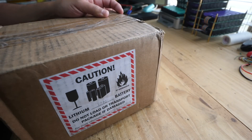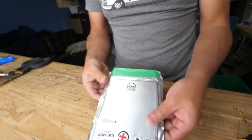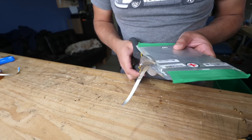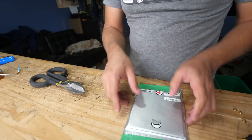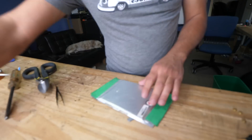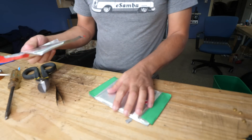The first thing is to build the battery packs. We've chosen these 8 amp-hour lipo pouches. In my opinion, these are packaged a bit weird — the tab is kind of too long. So what I want to do is cut it shorter. Make sure you don't cut into the cell; it's only the little tab. You've got to make sure that all the excess material is cleared out, and get the sticker off. Because you're going to stack these on top of each other, take out as much scrap as you can so it doesn't get in the way.